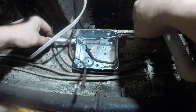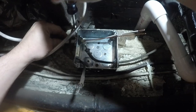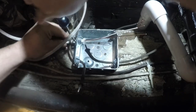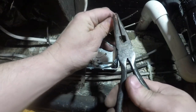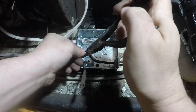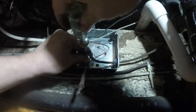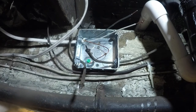Now I've fed the wires into the box and kept them organized so they maintain their distance from each other. For the ground, we only have one wire going into the box, so we don't need to pigtail it in any way. The wire goes directly from the 14-gauge romex to the box with a ground screw. You need ground screws — you can't get anything done with electrical work without ground screws. That's not something you want to forget to grab.